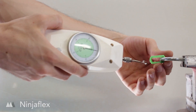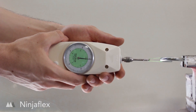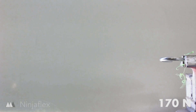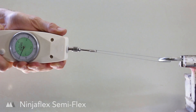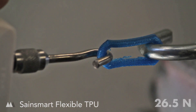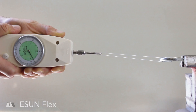Finally I tested a handful of flexible filaments, starting with the famous NinjaFlex. As you can see, it stretched quite an impressive amount before breaking. The semi-flex, also by NinjaFlex, is a little bit more stiff and proved to be a little bit stronger than its cousin. SainSmart also makes a flexible filament which is cheaper and actually prints really nicely, but it can't stretch quite like NinjaFlex can. The same goes for the eSUN flexible filament, which is probably the most rigid of the flexible filaments I tested.